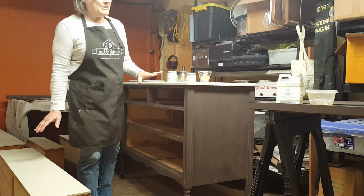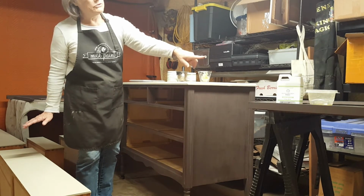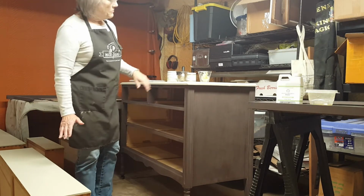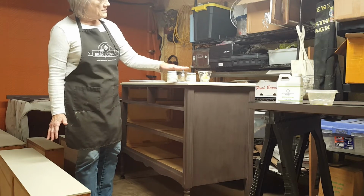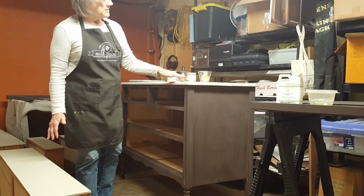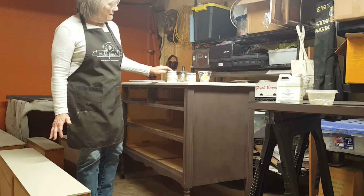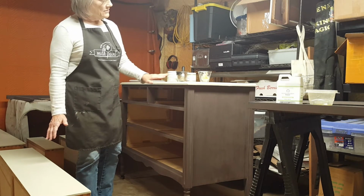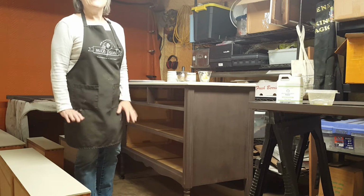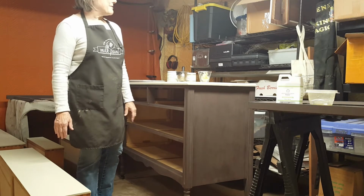In this case, I'm going to do a mixture of oil, hemp oil, known as Miss Mustard Seed's Milk Oil, and that'll be on the Curio, and then the Carolina Dune I'm going to seal with some clear furniture wax, Miss Mustard Seed's Milk Wax in clear, and I might add a little bit of antiquing wax in some places where there is indentations and such to see if that brings it out a little more. I'm going to wait and see on that. I may or may not.